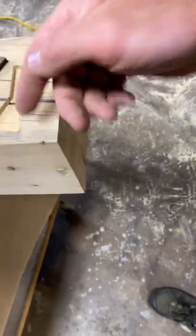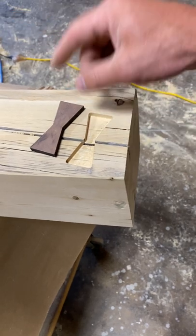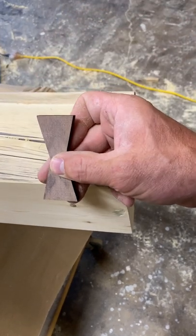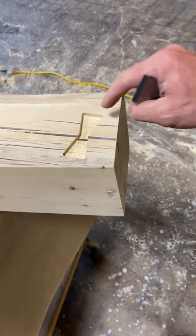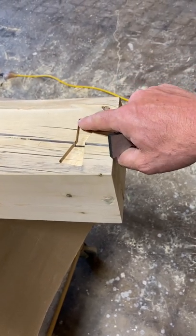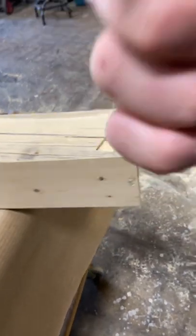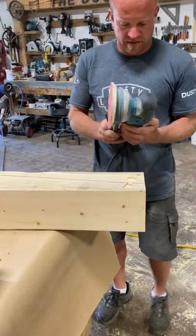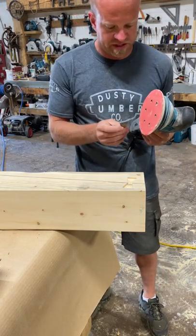Now you see it's all cut out there, and the corners of the bow tie will still have the radius of the router blade on it, and these bow ties don't come with that radius. So there's two ways to go about it: one is to chisel those out so they're perfect, which I used to do, or to round these edges off. I kind of like rounding the edges off now, so I take my random orbital sander and just round the edges off. It doesn't take very much, just a bit.